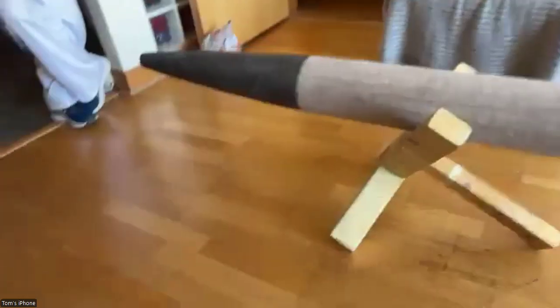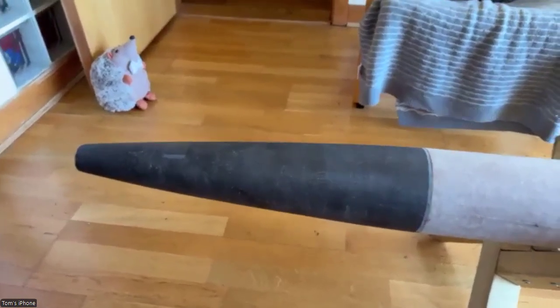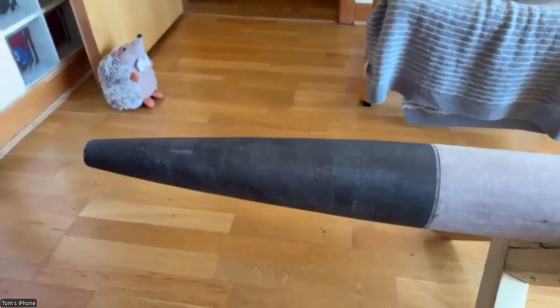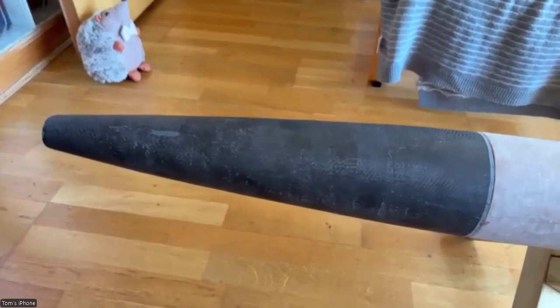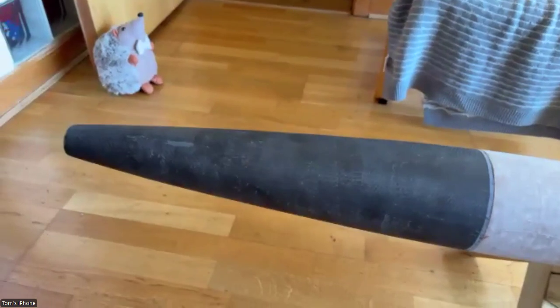Okay. If you want to slide on to the nose panel. Yeah. So the nose cone we've got here is a 5:1 von Karman, which has been 3D printed out of Onyx, which is nylon with chopped carbon fiber filament suspended in it. We've then skinned it with a couple of layers of carbon fiber and some heat-proof epoxy to help it survive the supersonic heating that might be acting upon it.